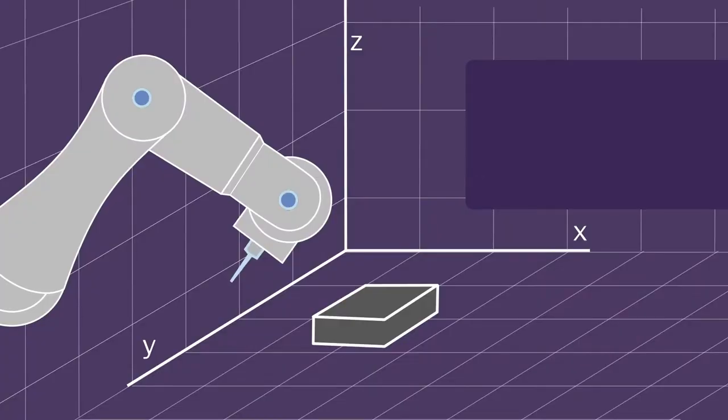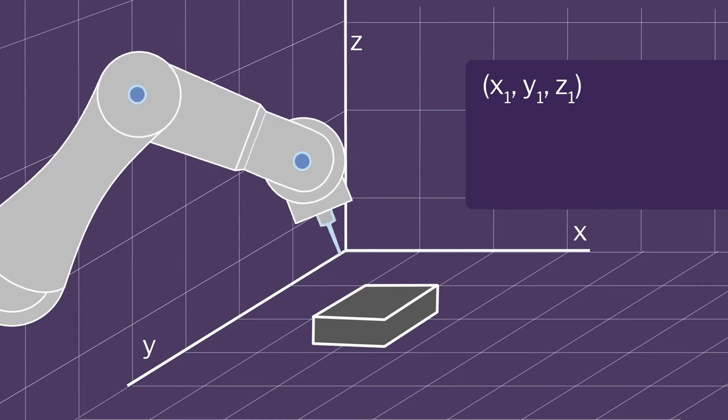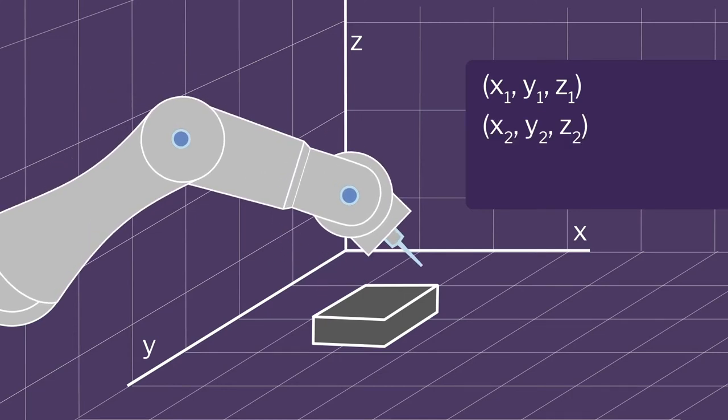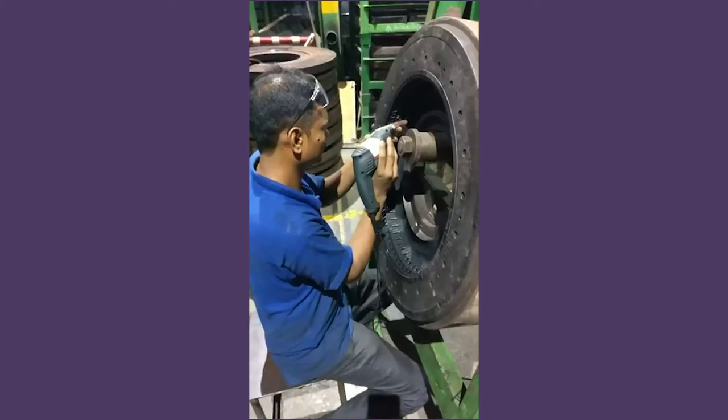Scanning is not 2D, it's a line scanner. But this line scanner is in space. So I have the data of where these lines lie. Right? Where these lines lie in space. So this line would give me, but every line is at some XYZ of the robot. I can combine all the data. I can get the data from the robot, get the data from line scanner, and create a 3D map of it. So that's what the student does.